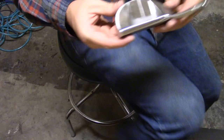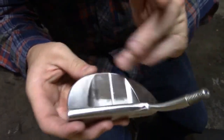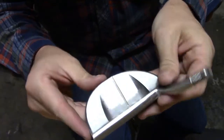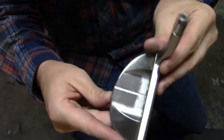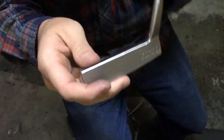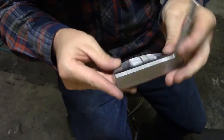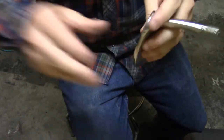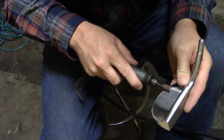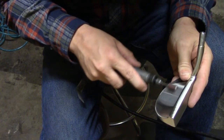For the very last part of this grinding tutorial, I'm going to talk about using the Dremel tool. There are parts of the putter that my grinding wheel can't reach, and in order to remove flaws I have to use my Dremel tool. Normally I use 600 to 800 grit sandpaper. However, going through my shop it appears I am out of both 600 and 800 grit, so the highest grit sandpaper I had was 450. I would not suggest attempting this with less than 600 or 800 grit, and I would not suggest trying it with 450 unless you have a lot of experience with a Dremel tool and a very steady hand, because this will damage your putter super fast if you don't know what you're doing.